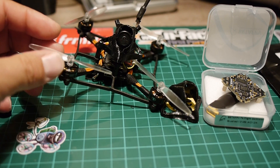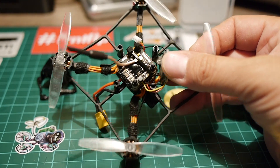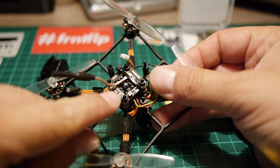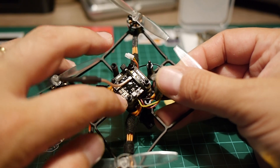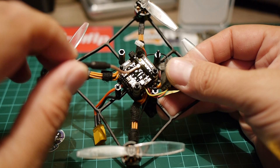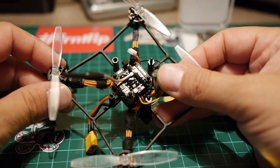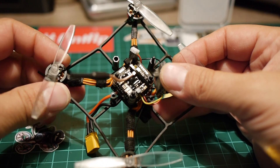I hope to manage to make a way better looking machine. I also forgot to mention: why am I replacing the VTX? Because the default one, a Pro 32 from TBS, is soldered onto a 16x16 board made by Diatone, which is very nice. But I feel I'd spend quite some time unsoldering those things and dismantling it for the new build. So I'll leave that for another occasion, and replace it with the TBS Unify Pro old version — first version — which I think is a bit lighter than this one, making it more convenient for a lighter build.